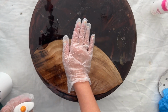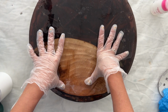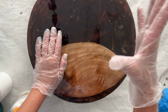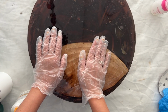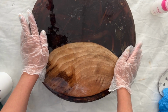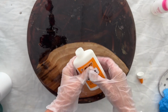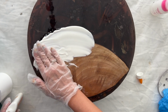What this layer does, when we're going to apply the caramel edge on top, naturally the drops will flow down the sides, and to avoid having to regrind this surface, if you've done it well and don't want to cover it again, you need to protect it. You can use latex, you can tape everything up, or you can apply several layers of glue like this. When the drops fall, it hardens like a film. You just tear it off, and it tears off together with the drops that remain from the finish. So now I'm applying it, I leave it to dry well, then I flip it over.